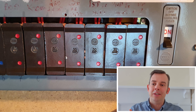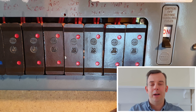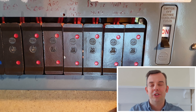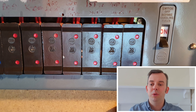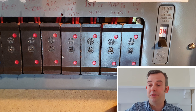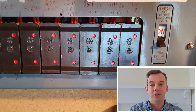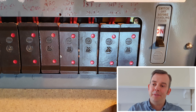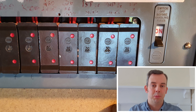The second thing to bear in mind is overload protection. When selecting the correct cable size for an installation, there is a correction factor of 0.725 when rewireable fuses are used. If you look at the rating of the protective devices on the picture and divide, say, 15 amps by 0.725, that gives a good idea of the effect on the cable size you need to select. If the cable size is not high enough, that protective device would not protect against overload.